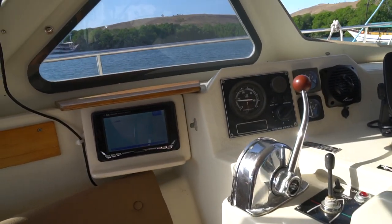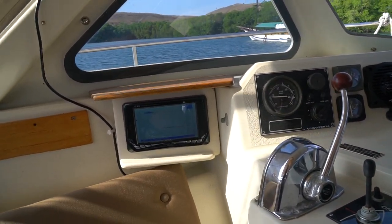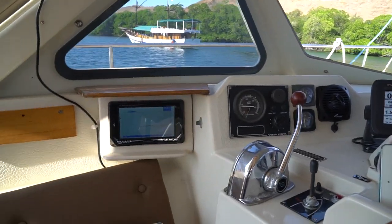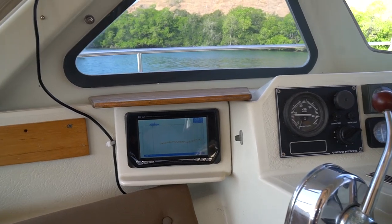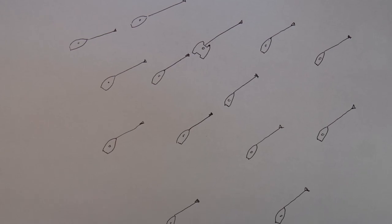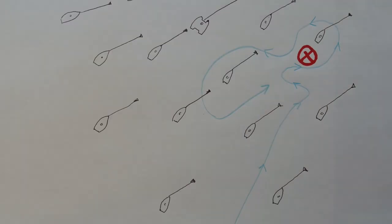Seven, when I come into anchor, I always have my Echo Pilot on. I look at the place where I want to drop my anchor and the slope of the bottom. I also want to take a look for any bommies or reefs close by. I zigzag through the anchorage and try to get a good idea of the bottom scape which will be below Aquarius.